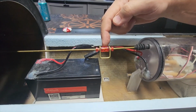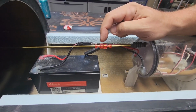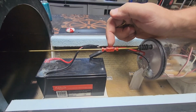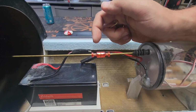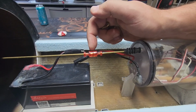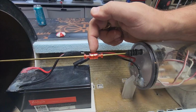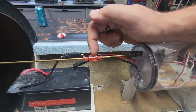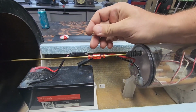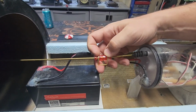Magnetic coupler for the forward dive planes. Now you can see when this was given to me, these were Dwayne's magnetic connectors, and these I believe you just get from like Home Depot. They're tacks for like on your refrigerator to put notes up there. They work, especially on smaller boats, but the magnetic force is not tremendous. We manufacture what we call click-ons here with rare earth magnets that have probably double the connective force in these. And so just because there's so much force on there, we manufactured these little clips. And these just go on like that.